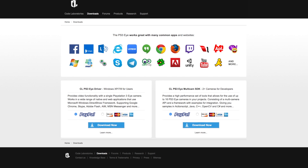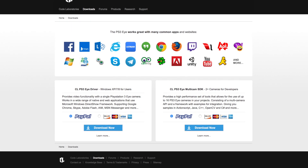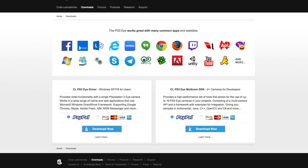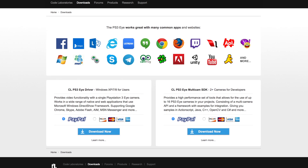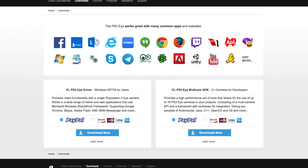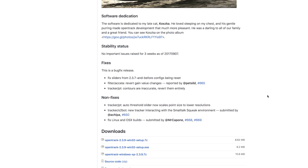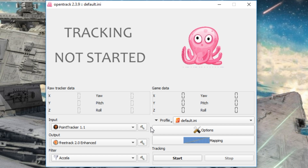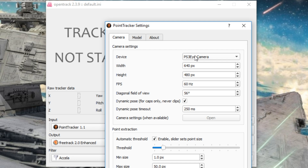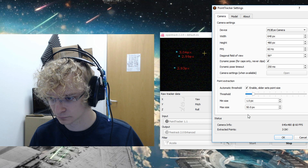We need to get drivers for the PlayStation camera. We're going to be using CL-Eye — I'll link their site in the description. There are free versions of the driver available, though they sell copies for only £2.99. Since it's so cheap and we're saving quite a lot of money here, I decided to just pay and support the development, though free versions are available if you want to search for them. Once that's done, download and install OpenTrack — I'll link it below — which is what actually does all of the tracking. Open OpenTrack, put your headset on and plug it in, then tap the hammer icon next to point tracker and select the PS Eye camera, then tap Start. Tap that hammer icon again and slide the thresholds to the left until only the three LEDs from your headset are showing.